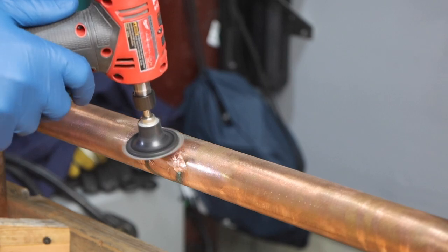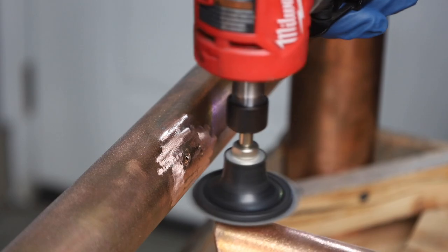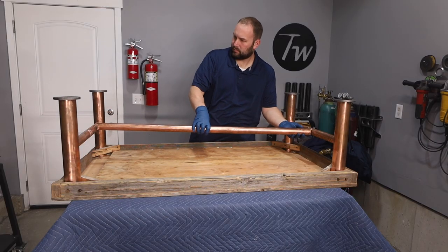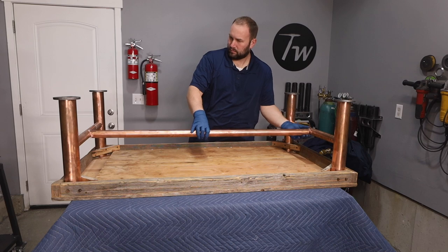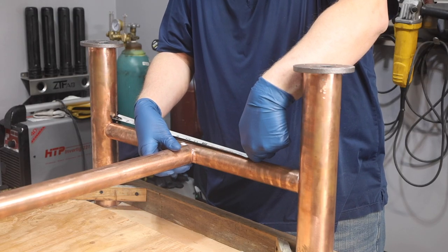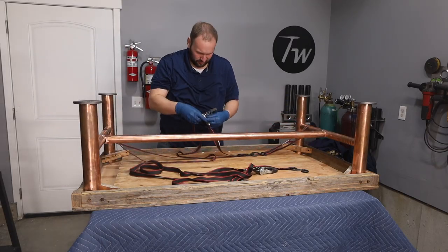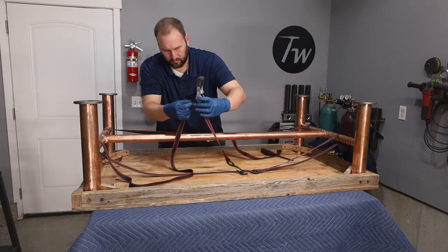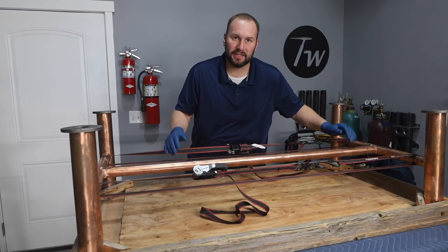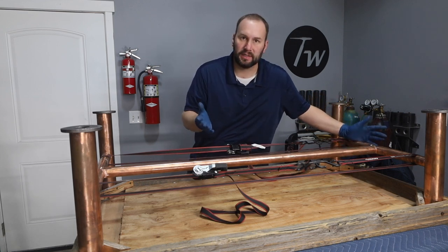The first thing I'm doing is removing these screws and cleaning everything up so that solder won't be in place, and I'll be able to get a nice clean joint when I go to braze this together. When I put the crossmember in place it fits okay, but things have pulled apart a little bit so I need to center it up, then use some ratchet strap tie-downs to hold everything in place and square it up — these are a really useful tool to have around the workshop.